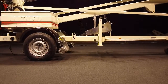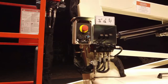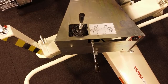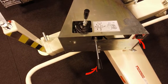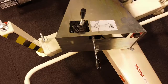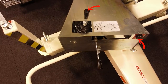If the lifting platform is equipped with a self-drive system, this will be the operating procedure. With the key in ground position and the hydraulic faucet open in vertical position, we simultaneously operate on the front tray, the electric push button, and the control in order to move the rollers near the tires. Subsequently, to carry out the movement, we simultaneously operate the electric push button and the omnidirectional control in order to move the lifting platform easily.